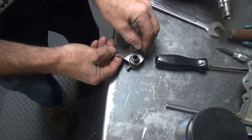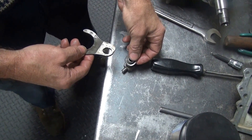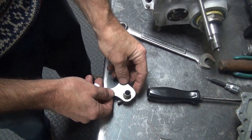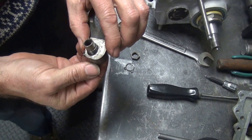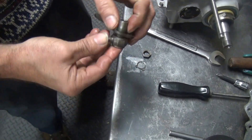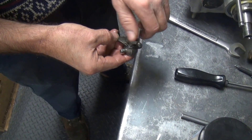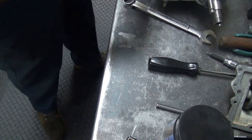Make sure you don't rotate anything when you take it off because everything is a certain direction. So you've only got two washers here - remember I told you I want to go two? And they make these in seven and fifteen thousandths thicknesses. These ones feel like... they're both fifteens. Back in the dog right there, little keyway right there. There's our worn-out lock tab - put that back on for now. So we're out of washers on this one; if that's not enough we'll put some more on. Okay, so that one goes back in.